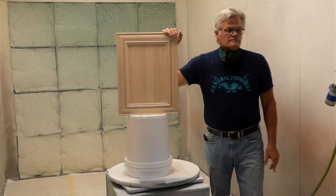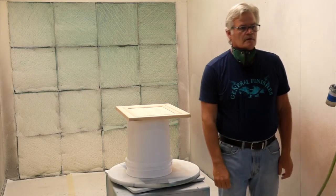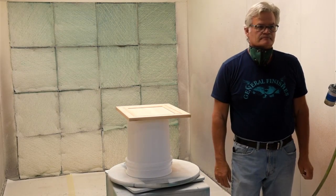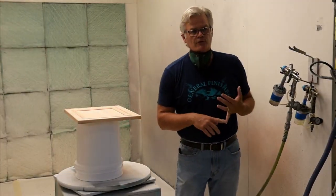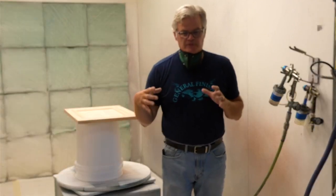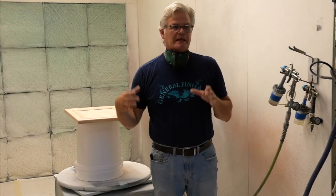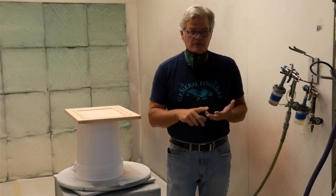Marcy, excuse me, can stain blocker be tinted is the first question. No. I'll tell you why. And then the second question is, can you do this in sunlight without issues? No. So the questions are, can the stain blocker be tinted? No, and the reason for it is the chemistry of the stain blocker is unique. It's not just a run-of-the-mill water-based acrylic primer. It's a fairly sophisticated resin system that was developed, and the reason for it is it was the one system that we found that actually performed the function of blocking out tannins and bleed-through. So we don't tint the stain blocker. We can tint all the other pigmented products.